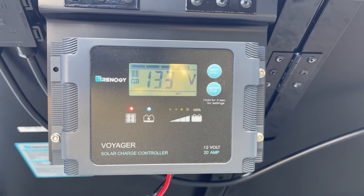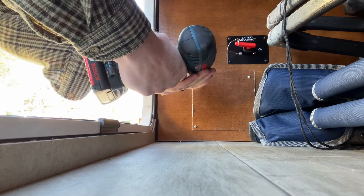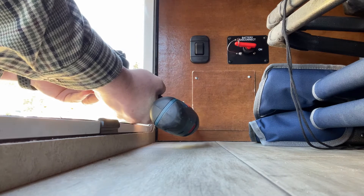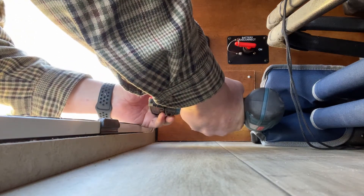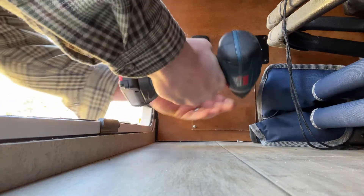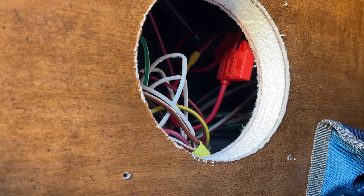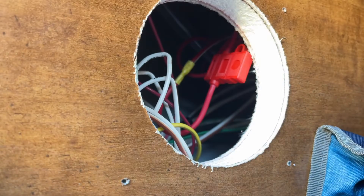Now, if you have a Lance travel trailer and your Renogy still shows the same error message after you reverse the polarity, here may be an extra step. The Lance has two fuses on the other side of the travel trailer behind another body panel. It may be that while switching the polarity of the solar on the side, you accidentally blew one of these fuses. Go to the other side of your Lance travel trailer and open the panel just inside the storage bay underneath the battery. There are likely two fuses: a 30-amp and a 15-amp fuse. You open them by sliding the red cap off of the fuse protector. Check the fuse — if it's blown, you'll need to replace it with an equivalent amp fuse. Fuses are inexpensive. There's a link in the description to the fuse kit we keep in our travel trailer, but hopefully you'll have a spare you can use.